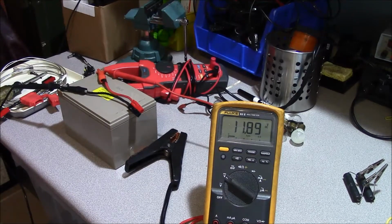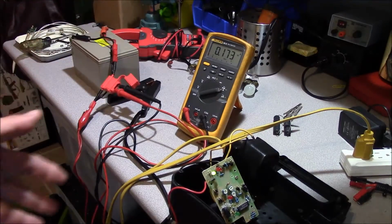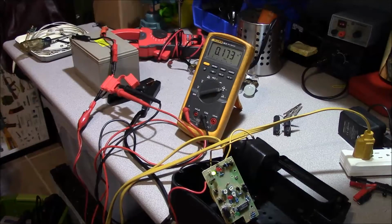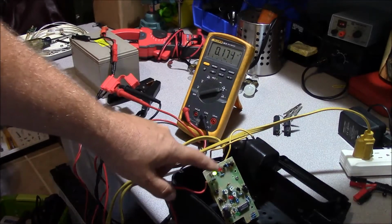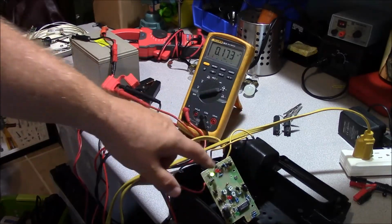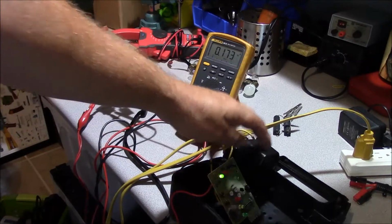this charger is working. Okay, we just plugged our charger into our discharged cell, and you can see it's putting less than 200 milliamps into the battery, and it's still staying in a low charge rate. It's not going to high rate at all, so we're probably going to go ahead and dispense with this charging